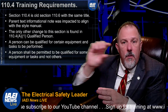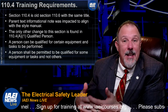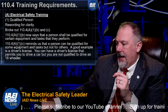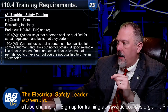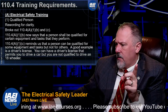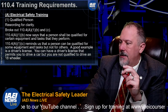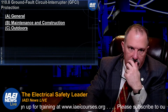But remember, you have that overarching dialogue that the qualified person has to be trained and knowledgeable on the electrical hazards associated with the environment as well. All right, so in 110.4, titled Training Requirements, this is A1, 1B and C, and I think I just read that B and C is broken out into two. Again, I would say almost that B and C are very similar. I'd have a hard time justifying why we had to put C in there, but that's just me.